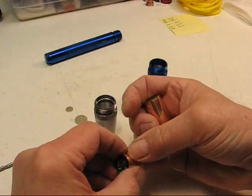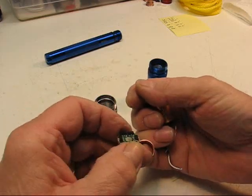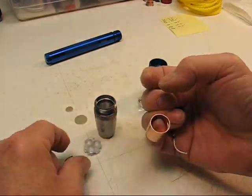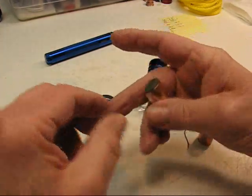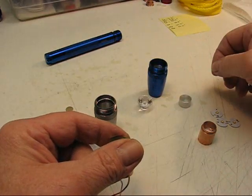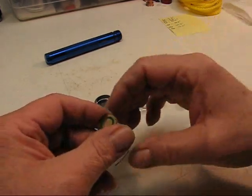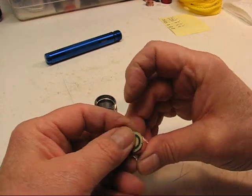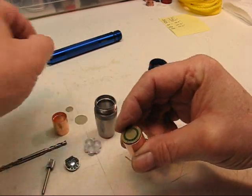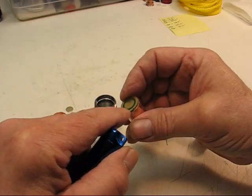The driver has to be also shaved along the outer edge because it's 17mm and we're closer to 16mm on the inside. So I have to sand a little bit on the outer edge of the driver and open this up a little until it all fits together. On this one, these 1.4 amp, when I'm just going to do single LEDs — the little Nichia 219s on a 16mm star — then I'm using a single-sided driver, 1.4 amp, and that will actually be the base for the negative. The body will be able to touch against that.